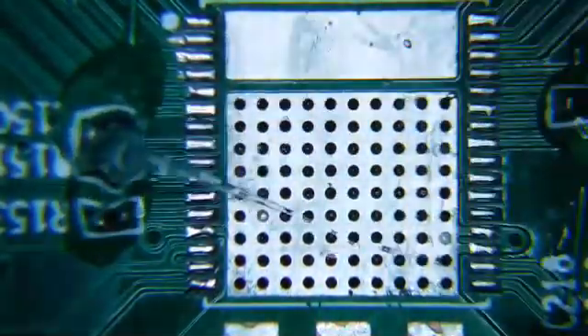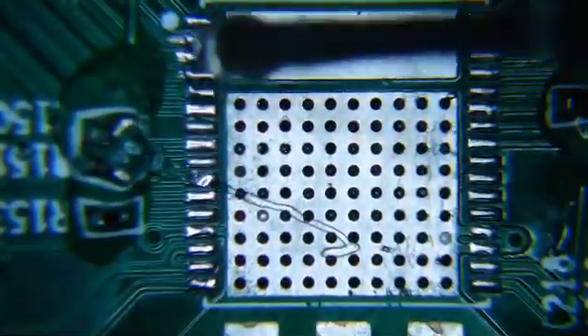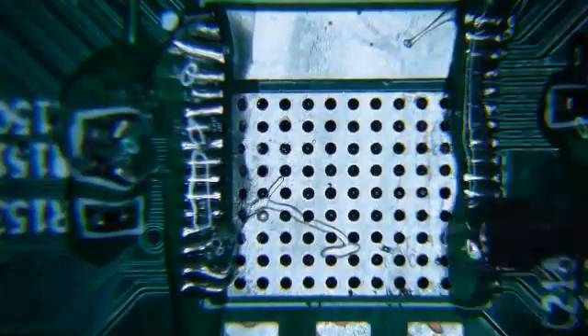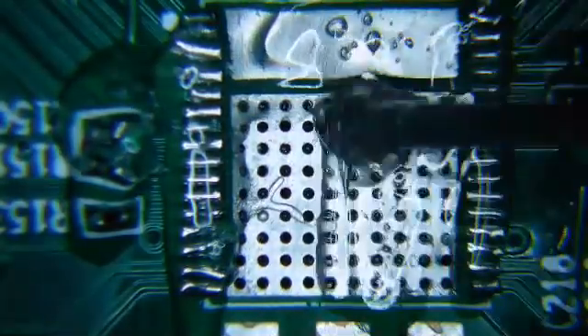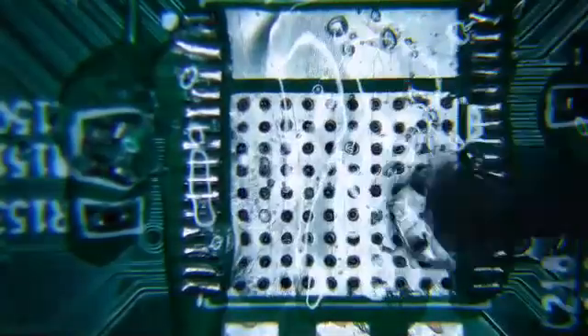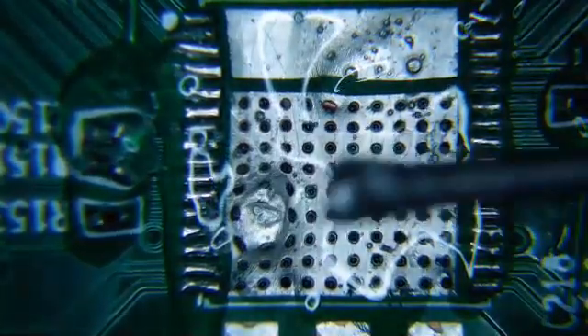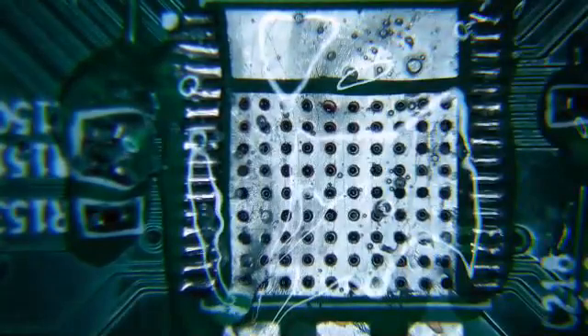I think that's everybody kind of around the board. Now to get the board ready, I'm going to put a good coat of solder on the legs, both legs. And then I'm going to put solder where the chip goes. I try not to put too much — I'd rather float it on the legs — but it starts to boil and throws the chip off and separates the solder. I probably have too much if that happens, and I'll just keep working with it.